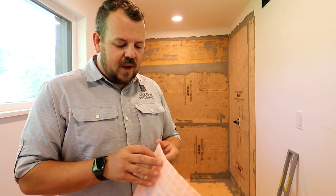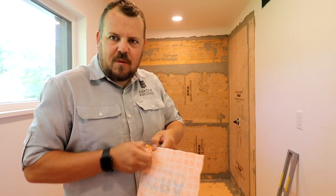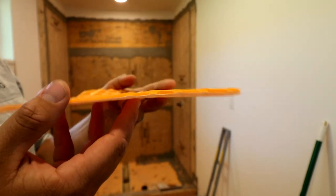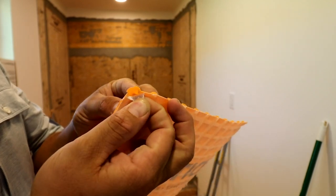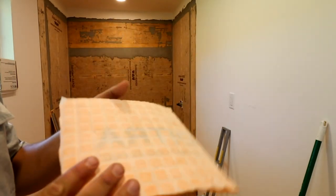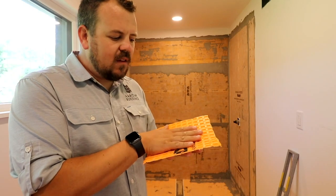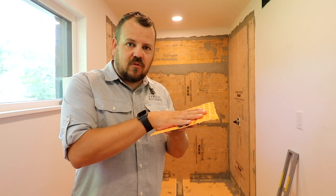It is a fleeced-back membrane and the two parts — you can see I can force them apart if I had to, I can tear that. The idea is that the fleece liner gets adhered with mortar and then the tile gets adhered with mortar on top. The two have just enough movement built into their shape. These little squares are actually a dovetail shape, so the mortar pushes in and grabs that — and on the underneath side, the mortar can push in and grab too. It gives just enough flexibility to make it so that our substrate generally doesn't affect our tile.